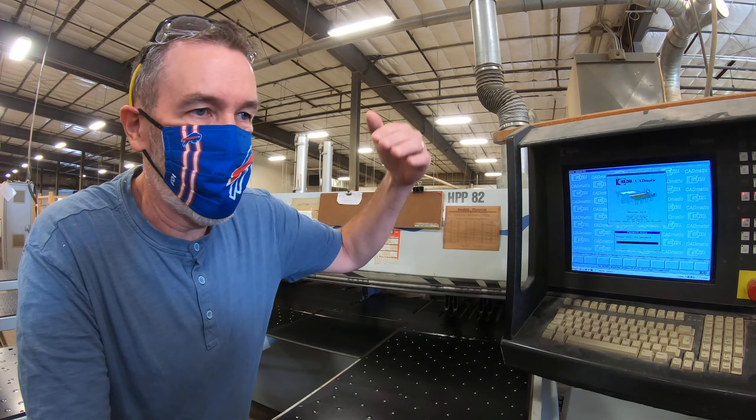Pretty much the fixed fence is pretty self-explanatory. The other one we do primarily is cut to length. Now in cut to length there are a few different options. Typically we run it on the measuring box as indicated. What that means is when you start the sequence and the machine grabs the board, it pulls it in.